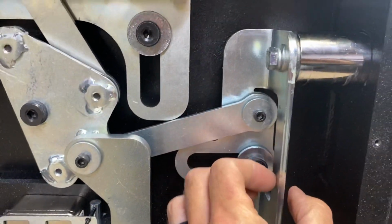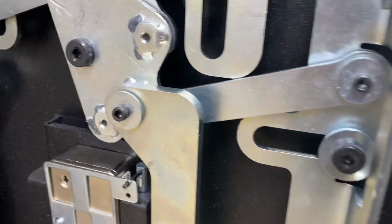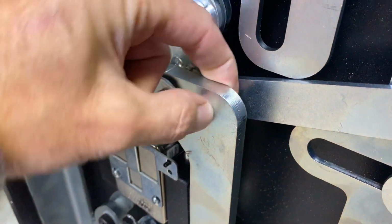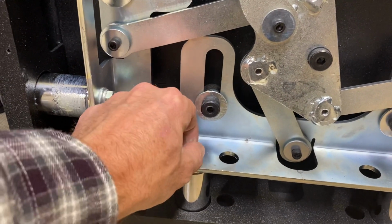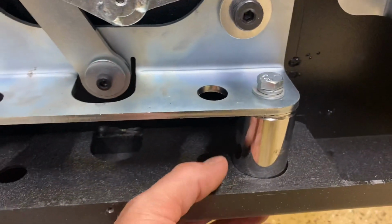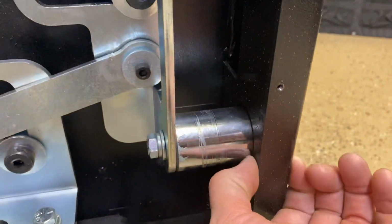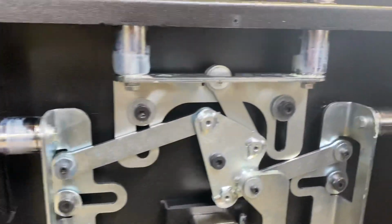All the bolt works is around, or at least the rails here, top, bottom, both sides is 3/16. But if you look at some of this stuff, this is 3/8 inch plate on all this steel that holds everything together. All the bolts on top of that are bolted through the rail system, and then everything is reinforced as far as where the bolt guides are. So this is not just one layer of gauge steel like you'll find on a lot of safes, but really thick, so nothing's going to flex or bend or move. I can't see anything that would be a weak spot on this BFX.